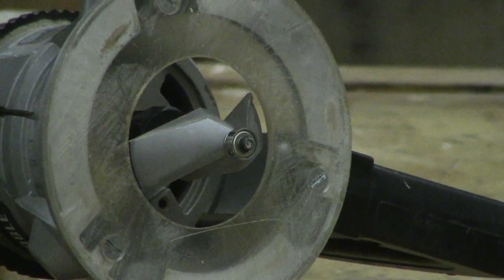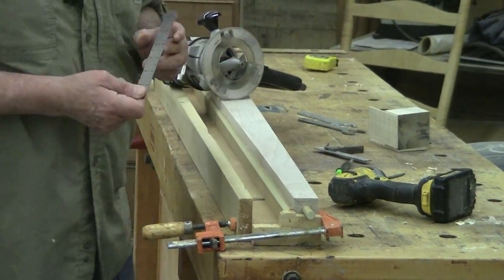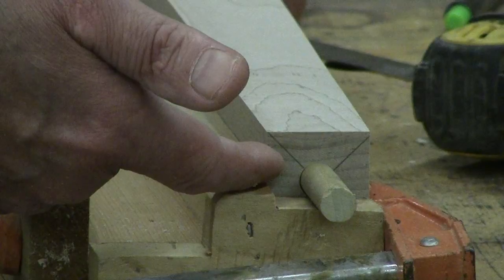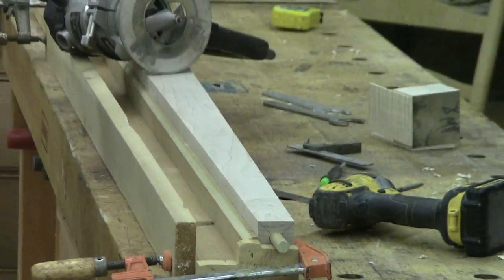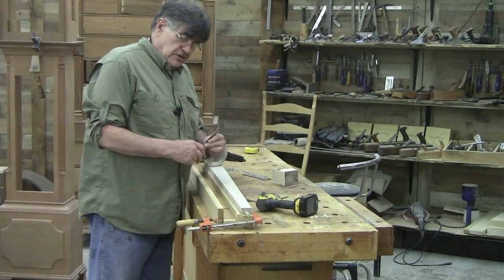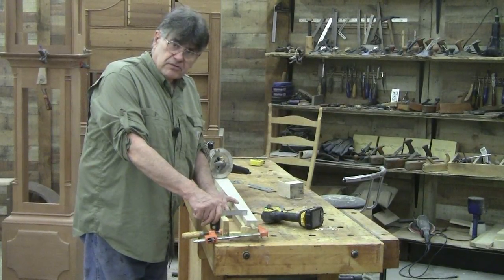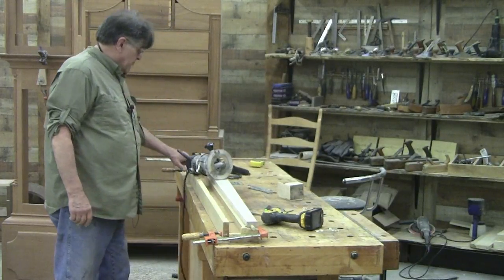In this particular case I'm five-eighths of an inch below the top of my post, same in the back. The reason for this trough is it's also going to act as a tilt guide. The other way to tell is you want the rail over here to be flush and level with your post. I've got a stop set up right here.